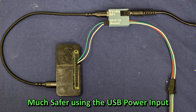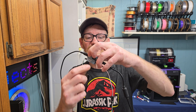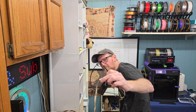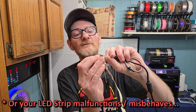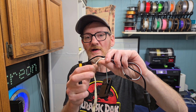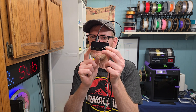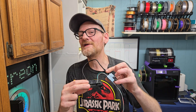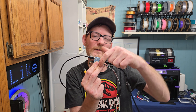So now you've got 3.3 volt logic going through here being shifted up to 5 volts and sent back out. Now what happens if we accidentally — say with a screwdriver or anything conductive — touch a five volt pad and the data pad at the same time? We just sent five volts right into a 3.3 volt GPIO. Without the level shifter, that's what would have happened and you'd be buying a new Raspberry Pi. My level shifter does not allow anything to feed back in that direction on this green wire — only this direction. It's completely isolated.